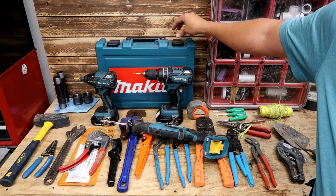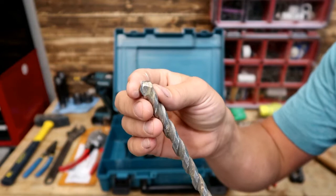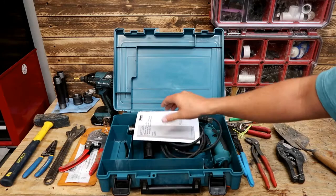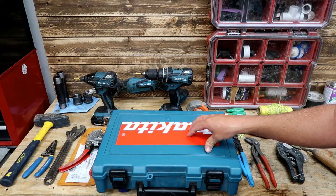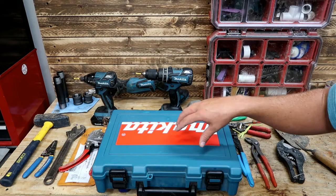We've also got our hammer drill back here. This is a quarter-inch hammer drill, and when you're putting in new systems and running wire into a garage or house, sometimes you have to go through the concrete foundation. For that you've got a specialty bit that's designed to go through concrete — really long. Sometimes those concrete foundations are 12 to 14 inches thick, so it's good to have a long blade. Sometimes we also need to get pipe through the foundation. If we're teeing off a plumbing line, we'll hire a plumber as a subcontractor, and then we'll also need to drill through the foundation, usually renting a drill with a big hole saw attachment — inch or two-inch — to core through that concrete wall.